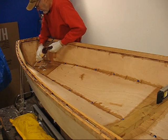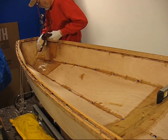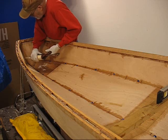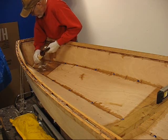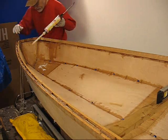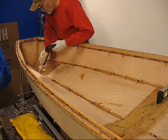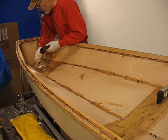Let's go down and fill in this void we've got here. I'll put a little bit more in — it's already sealed up pretty good. The fillet compound will do the final gap filling. I find it's easier to work in the direction of travel as you squeeze. It gets it in and pressurizes it into the groove a little bit.